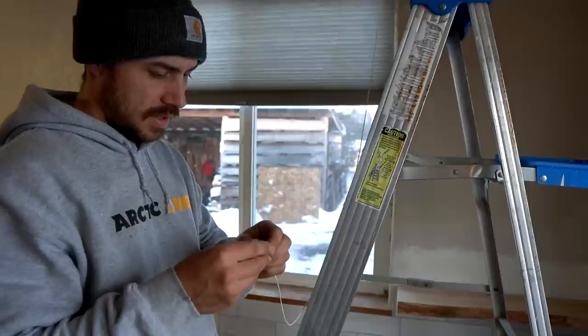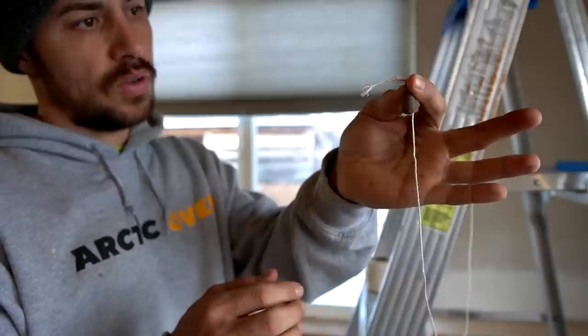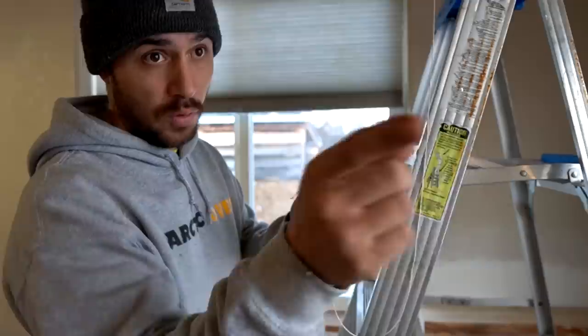One final little step here. We're making something called a plumb bob, and I have it on the exact center of the chimney pipe up there at the ceiling, and then I'm gonna put this little weight down, and we're gonna use gravity, and that's gonna tell us exactly where the center of the wood stove needs to go. So, get it to a good height here.